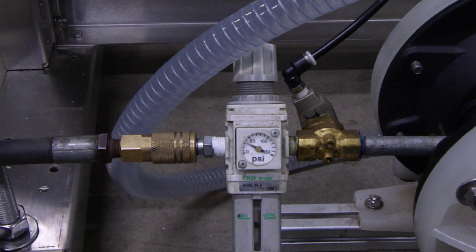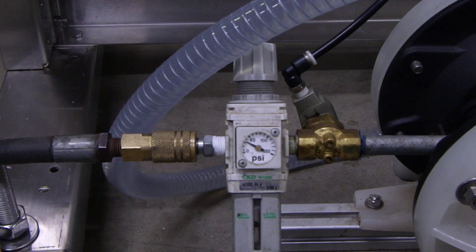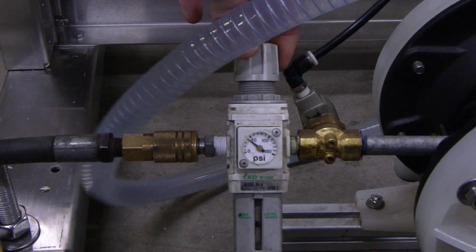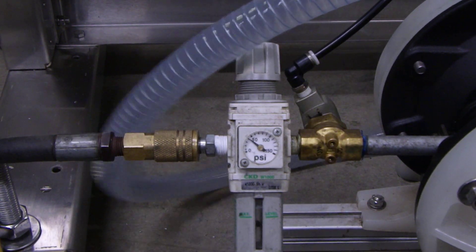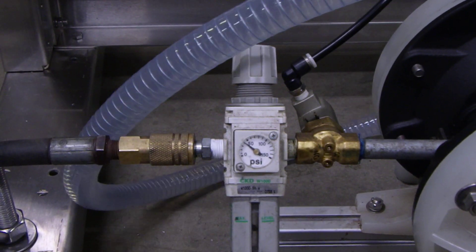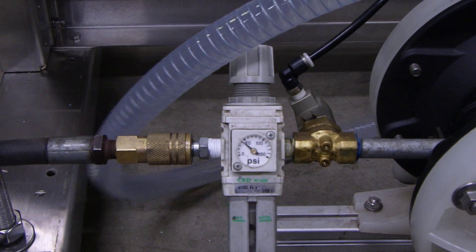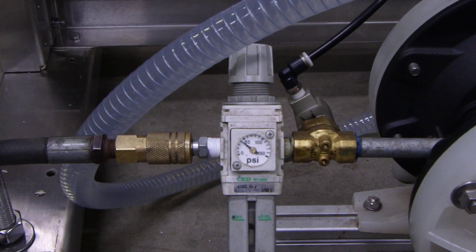Normally you're going to end up somewhere between the 25 and 50 PSI range on one of these. You'll just let that run, and as soon as it fills the tank up it will continue to pump until your float is satisfied in the tank. At that point it will shut off automatically.